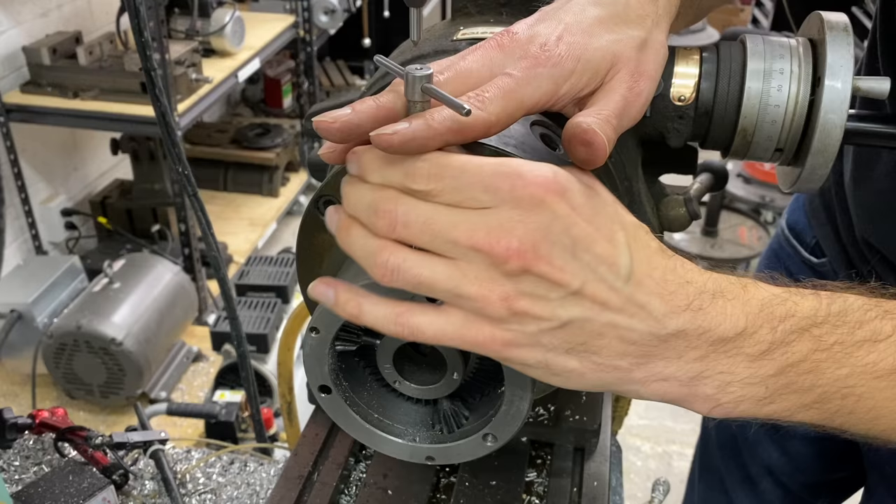What I'll do to start out is try to adjust it concentric pretty close just by feel. Looking at the indicator now — 13 thousandths. The indicator needle moving clockwise to its max position is your highest spot, and the set screw closest to that spot is the one to work with. Loosen that one a little bit, then go to the low spot and tighten the set screw there if you can. Go back to the high spot, loosen that one a little bit, then the lowest spot, tighten that. At the high spot again it's about 8 thou and we want to get to the point where the needle doesn't move.